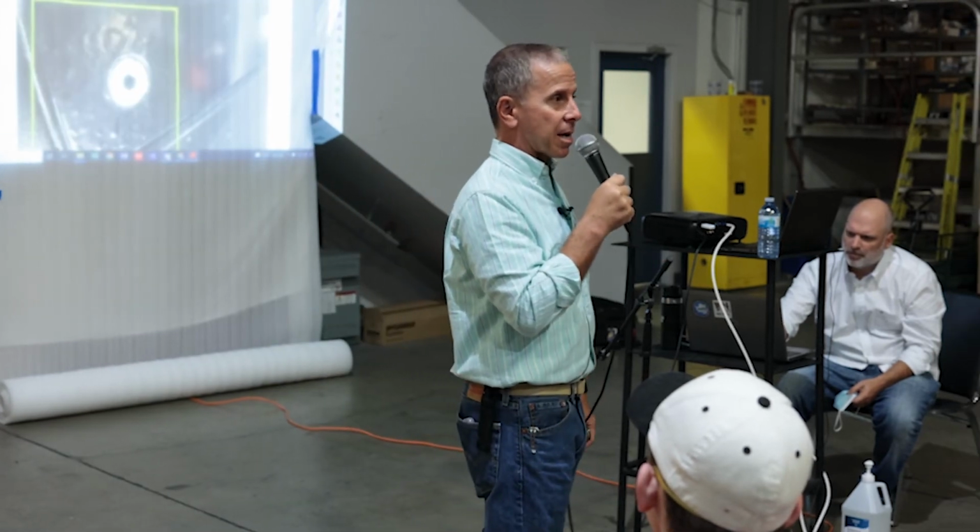Because it is a water trap, and again, something like wood in particular will actually hold water. It'll absorb it and keep that wet surface against the aluminum. So again, I discourage it. I would rather not use that. And some people say, well, how about synthetic teak? You know, that doesn't hold water.